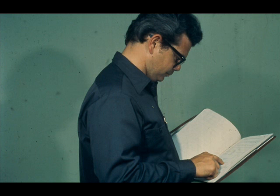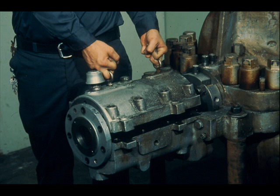The reading on the dial indicator is the amount of clearance in the thrust bearing. This is normally referred to as end play or lateral. Refer to the specifications in the manufacturer's manual to determine if the end play is satisfactory. If the end play is within the limit specified by the manufacturer, proceed with the remaining assembly. However, if the end play was either too much or not enough, some alteration to the bearing adjusting shim will be necessary.